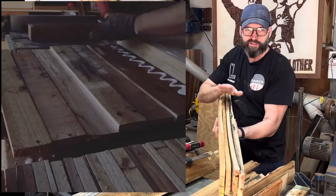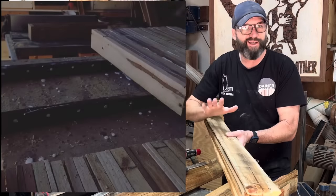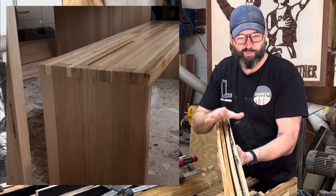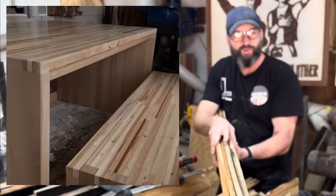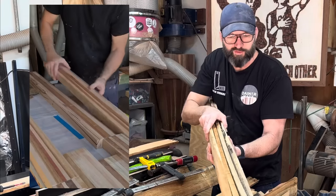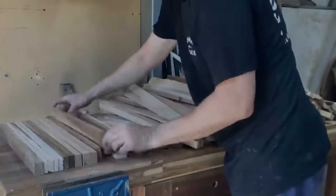When I got started, I did not do much to the pallet wood at all. If it was a little bit rough I would just hit it with a belt sander to clean it up a little bit, then rely on lots of glue and plane the life out of it. I knew the PVA glue wasn't that great and my gluing surfaces and bonds were not that great either. However, I would not rely on this gluing for any structural purpose — this was all about making a big chunk of wood and making it look cool with all the beautiful colours. I would build the structure into the project some other way to support the slab base.